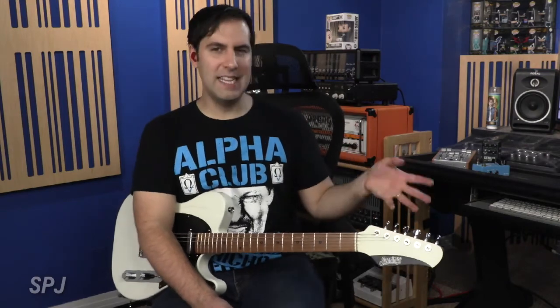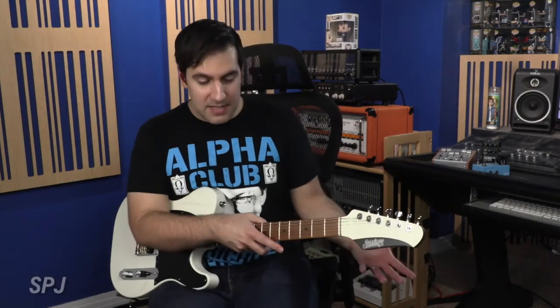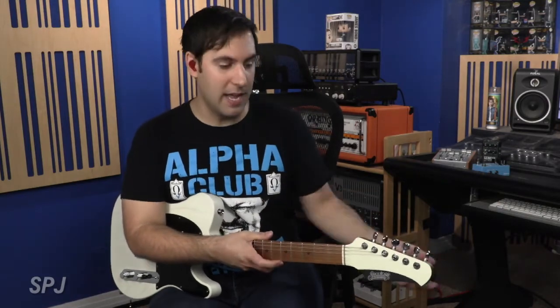I'd say if there's really only one gripe I have with this amplifier, it's that I think that there is a microphonic tube inside of it. Now, there are 12 AT7s in here. I don't have spares of those, and I didn't want to go replacing it with a 12 AX7 because then it wouldn't be representative of what you guys would be buying for yourselves, and that would just be not a very honest thing to do. But even still, there are settings that I'm not getting that high-pitched noise in the sound that I'm playing, and it's perfectly fine, and I'm having an absolute blast with it.